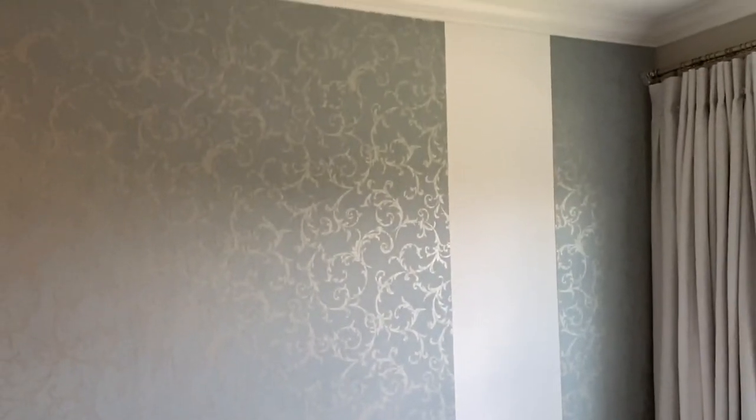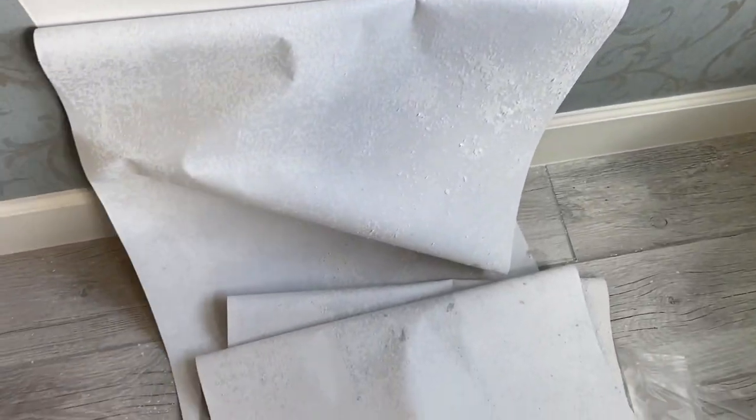It's an easy fix, but nonetheless, it's a problem. Let's fix this. Now, how do we fix this? You see this paste here? You gotta wet this down, because if you don't, it's going to cause a texture under your repair. And so we're wetting it. We're re-liquefying the paste so that we can float the paste.